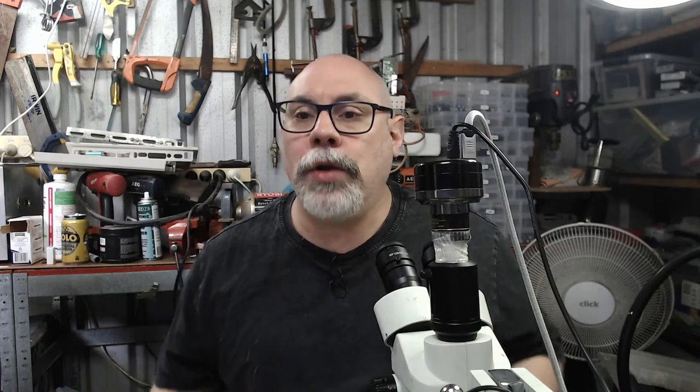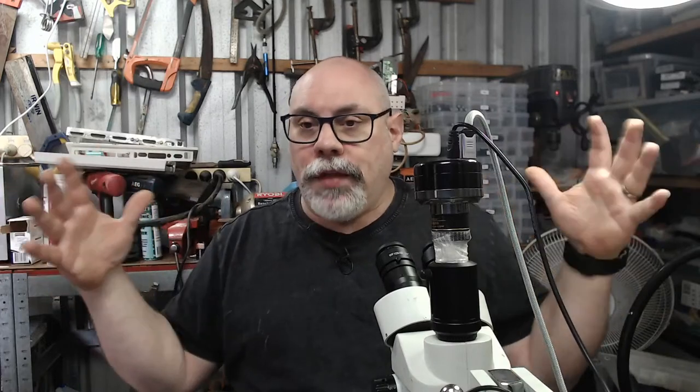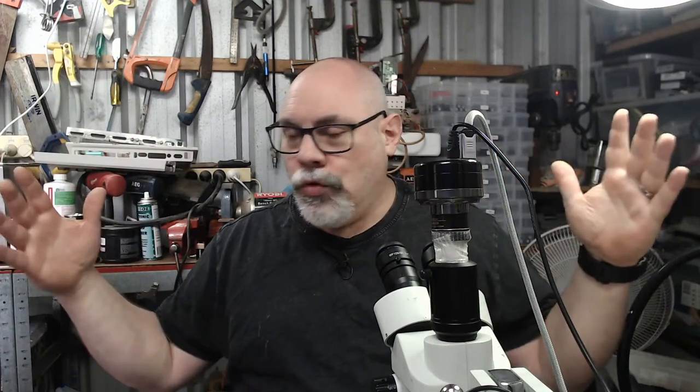Just following that up, Quadra 950. Yeah, no. You will end up spending a lot of money for an ultrasonic cleaner for a Quadra 950. Unfortunately, what happens with these cheaper models of ultrasonic cleaners, when you go up in size, is they just go incrementally wider. They don't go deeper. And for a board like that, I hate to think how big it's going to be, and you'll end up with a massive cleaner.